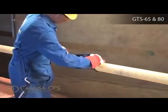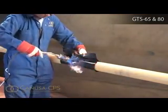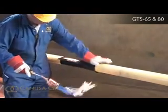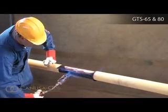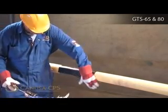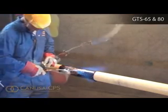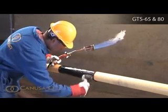Gently heat the top of the underlap, the adhesive side of the overlap, and the green side of the closure until it becomes glossy. Press the overlap and closure firmly into place. Gently heat the top of the closure and pat it down with a gloved hand. Repeating this procedure, move from one side to the other and smooth any wrinkles out by gently working them outward from the center of the closure with a roller.